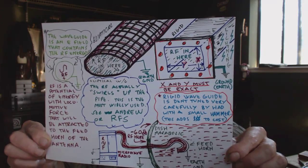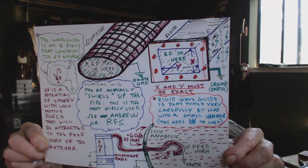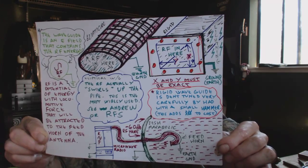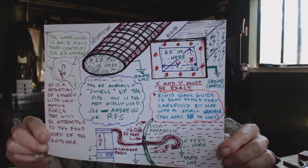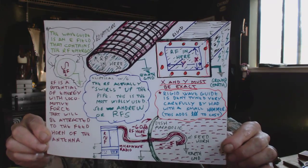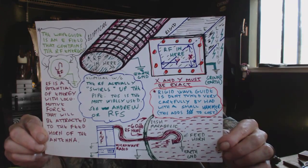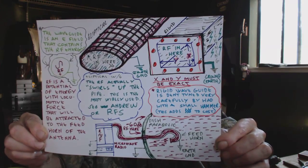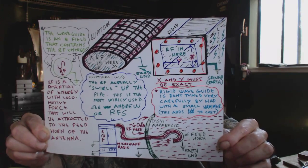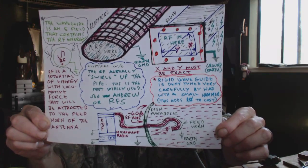The way you tune an elliptical waveguide run is to use a sweep generator and a network analyzer, and use a tunable connector or two tunable connectors if you so desire — it's not necessary and really not recommended. You run the waveguide from the building up the tower to the antenna, then terminate the top side, terminate the bottom side, connect it up, and there you go.